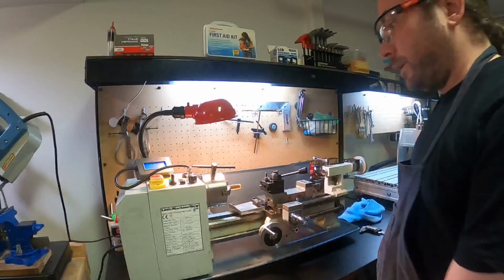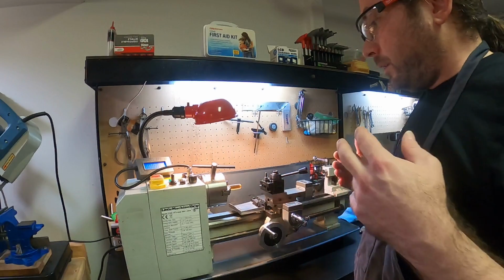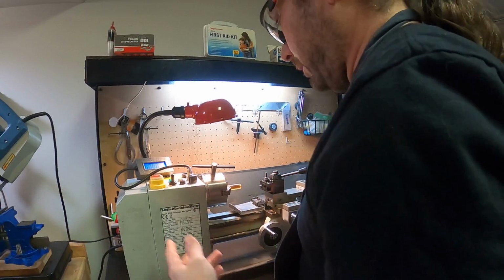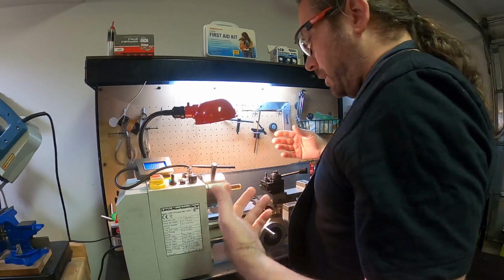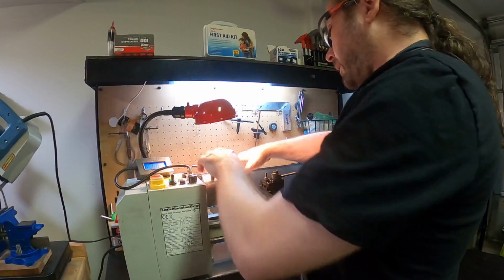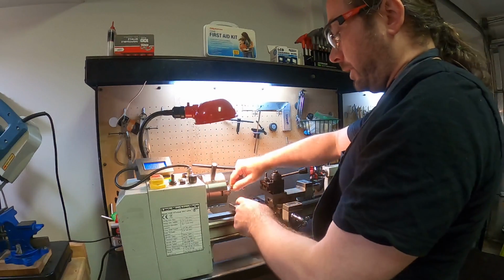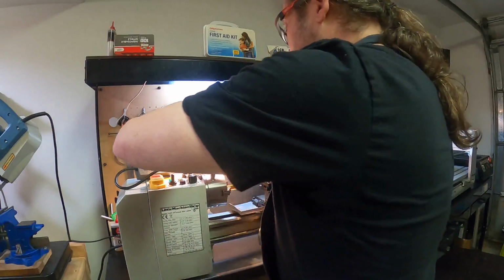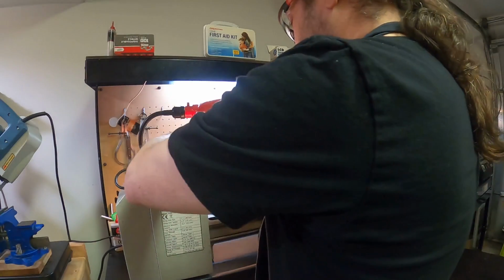Work in a lathe is what you are using tooling to remove material from. That's what the lathing process is. You turn some piece of work, you apply a tool to it, and you remove material in some way or another. There's a variety of different operations that you can do. What I'm doing right now is, as I'm tightening the chuck, I'm making sure that I turn the rod. If I do that in just the right way, it sort of helps it settle in centered.